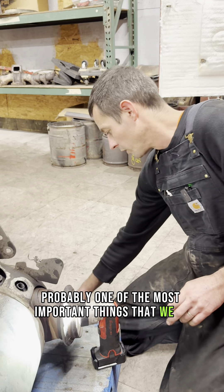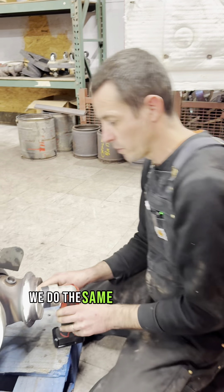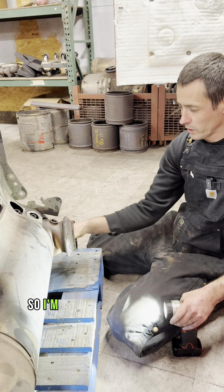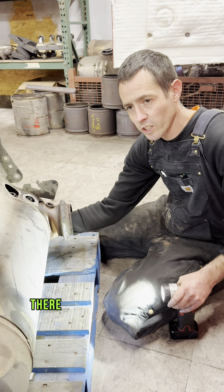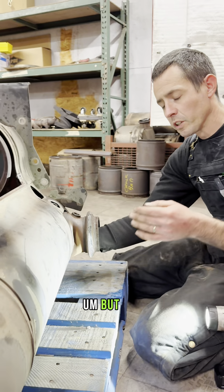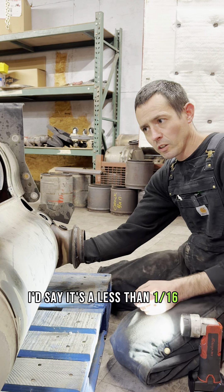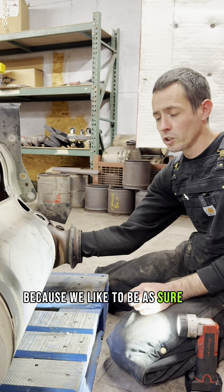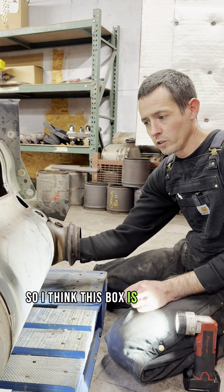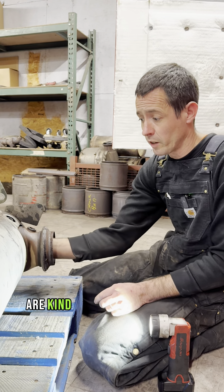Now probably one of the most important things we do is take one of these little rods and probe the SCRs, the same way we probed the DOCs — it's a little tricky. I'm actually pushing that in and on these there is a little crunchy spot, probably three-quarters of the way in, but I can push through it pretty easily. It's less than a sixteenth of an inch. I've probed this several times because we like to be as sure as we can. I think this box is cleanable, bearing no other prior contamination issues that are kind of out of our hands.